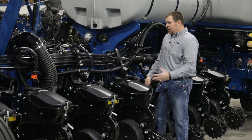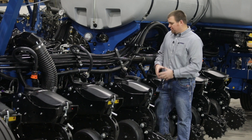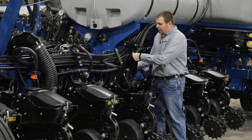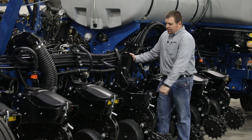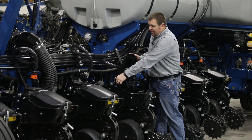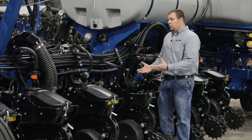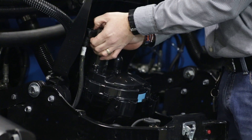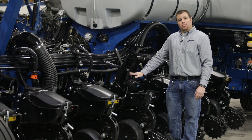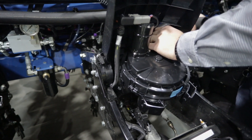So we can slide that lid back on. Let's dig into taking that meter off of the row unit more specifically. Once we latch it, we can rotate it up with everything connected. You'll see at the lower left there's a little kickstand that actually holds the mini hopper up so you can work on it. If we want to disassemble or check something on that meter, it's one simple electrical connection that comes off. Of course we have to disconnect our vacuum hose as well, which just simply pulls through the top of the mini hopper itself.